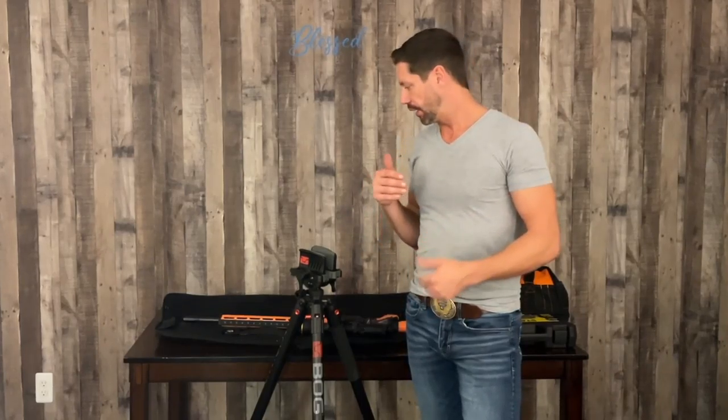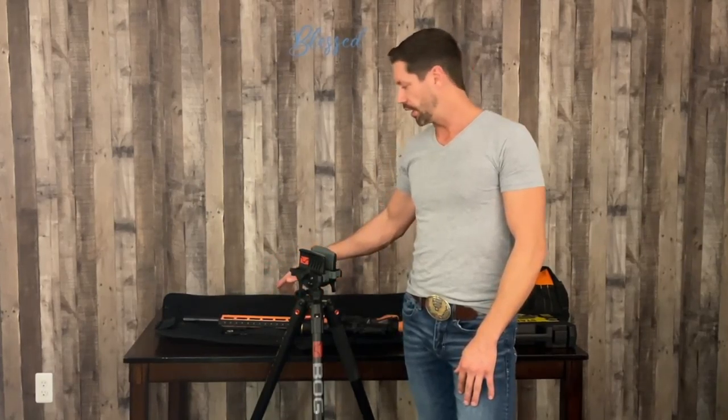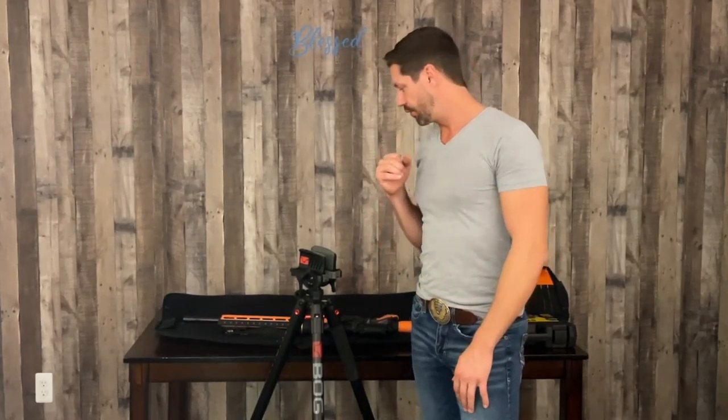And as you read these blogs, you'll find out that the Bushmaster uses a carbine length gas system, which is much shorter, which gives it more compression back at the bolt. And these aftermarket rifles that use a rifle length gas system on their 20 inch barrels have this issue. The more you read about it, the more you'll find out. Some people open these things up from a 0.104 to, some guys have opened up to a 0.12, which is the full opening of your gas tube at the back side. So that's a full flow system.